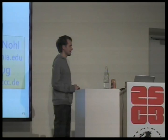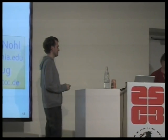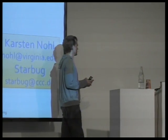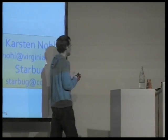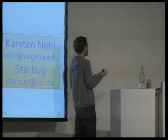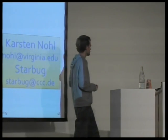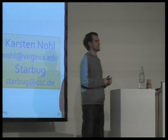Yes, well, it very much depends on your scenario, whether or not public key crypto is an option. So often what you want to prevent is that a device is being copied. If you want to prevent a device from being copied, you still have, even with public key crypto, to store some portion of the key on the chip that you need to hide from the attacker. And from what we can tell, these hardware devices are just not capable of keeping anything secret. That would be one short answer. But there are applications where public key would at least increase the security a lot, yes.